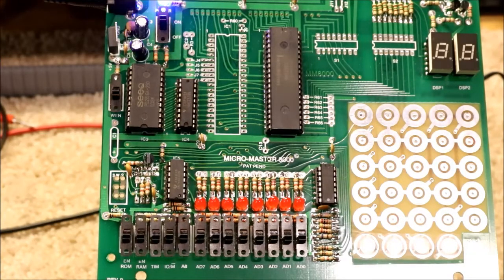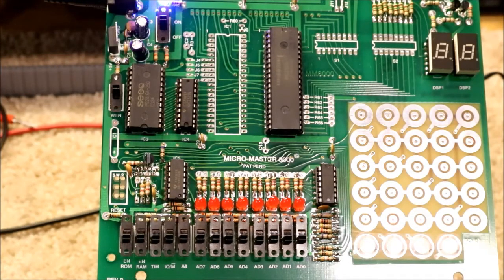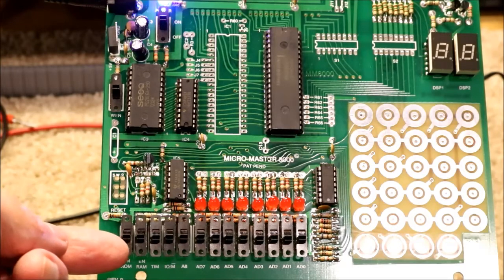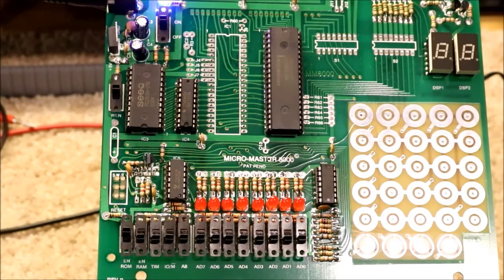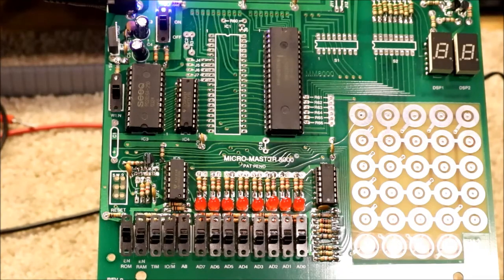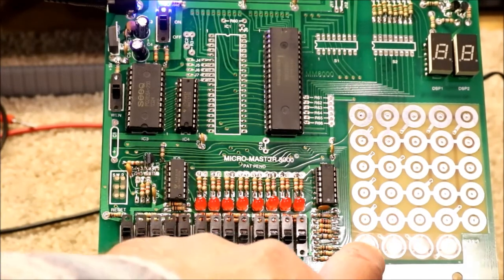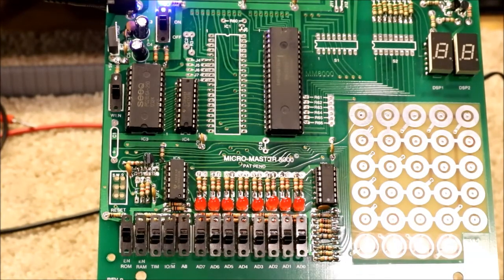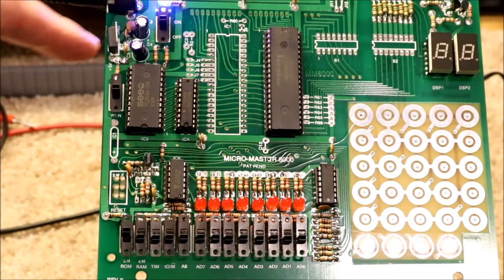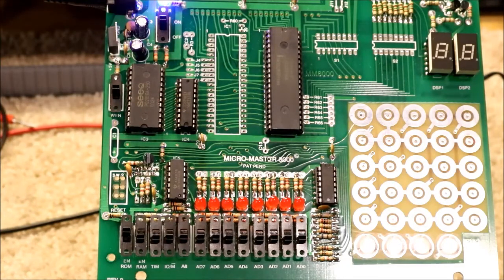And let's walk through writing some information in this to test it. So first of all, we're going to do the write enable, turn that on, so now we can write data into the double EEPROM. We're going to flip the ROM enable switch on, which makes the pretend CPU activate the chip enables on that chip. Now we're going to put address 0 out on the bus, just like before, activating address latch enable. So now the ROM has the proper physical address on its pins that we wish to read or write.